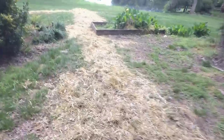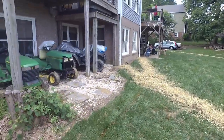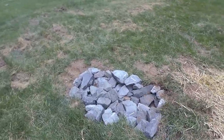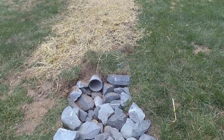came around, caught this gutter, and we caught these two gutters in 4-inch, and then we took them into our 6-inch main here, and I wanted to show you what the outfall looks like here that we did. So there's our outfall right there. So we got that armored with some riprap.